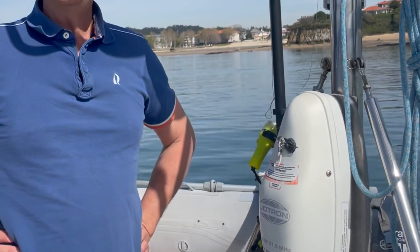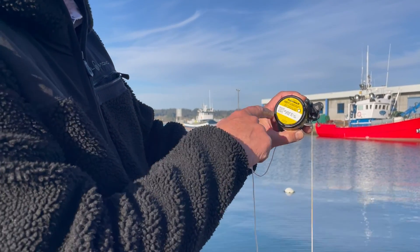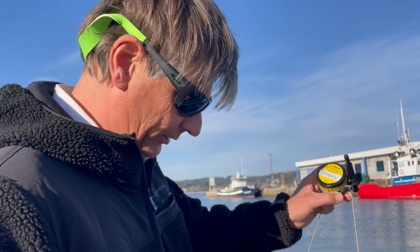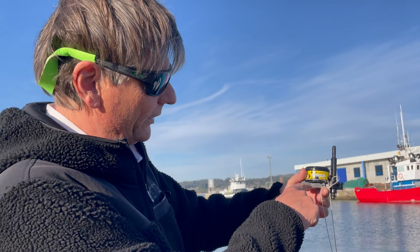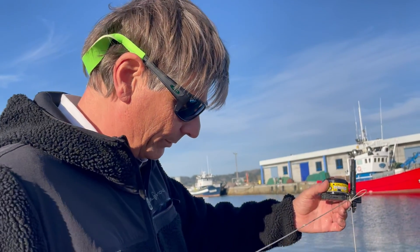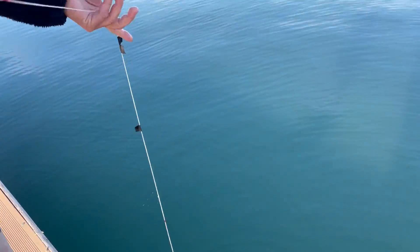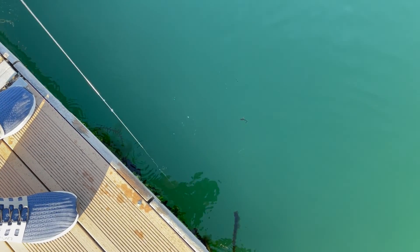The old H20 - that's what we're going to test to see if it still works. My old one expired from the EPIRB. It says release depth is one and a half to four meters, so when the EPIRB goes down one and a half to four meters, this should release a knife cutting the bolt and releasing the EPIRB. So let's take it down some one and a half to four meters.